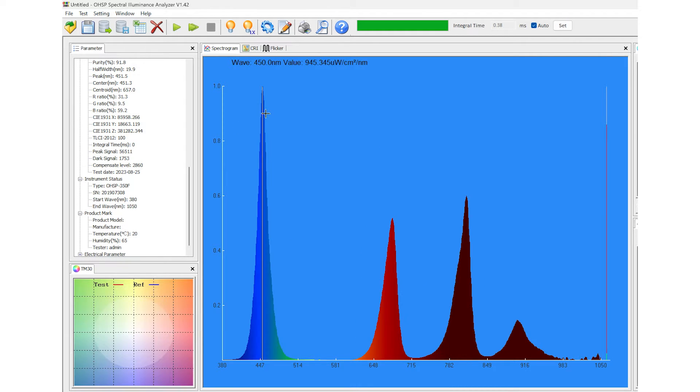Let's turn on the blue. The blue light is marketed as 450 nanometers and that is exactly what we're seeing. Here you see the full breakdown: blue, red, near infrared, and also an additional near infrared wavelength around 900 nanometers. What's unique is that when devices have blue LEDs, there's often a little bit of 900nm near infrared that comes into play. That only came on when I turned on the blue — it must be a design thing around the blue LED chips, but it's actually a bonus since you get a little extra near infrared when the blue is running.